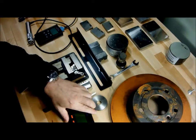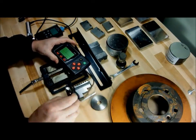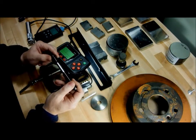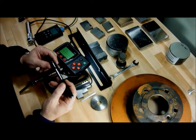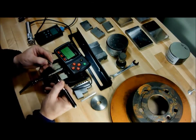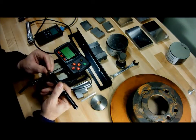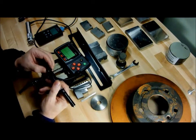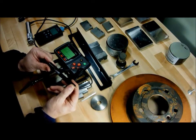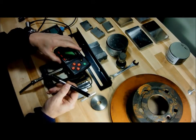This is the first kind — it is a rebound type. Rebound meaning that when the slug inside the tester is fired, it rebounds off the part and that acceleration is measured by this coil. That rebound works because we fire a little test slug at the material. This is that test slug; there's a very small carbide ball on the end.